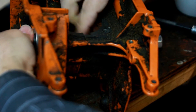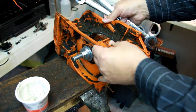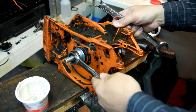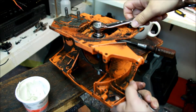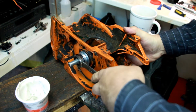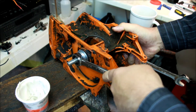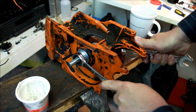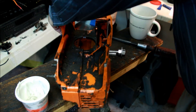Now, ensuring the ball bearings are fairly equidistant, you should be able to press on this. You can see in here, just got the rod there. I don't even have the positioners in here — I don't even know if this will work. So you hold the nut on this side — you can see I've just got some spacers there — hold the nut on this side and crank around down. We don't want any rotational force on this, because you don't want to move the balls out of alignment.